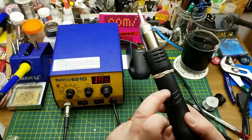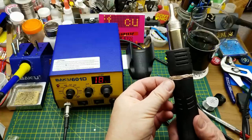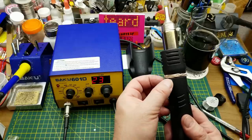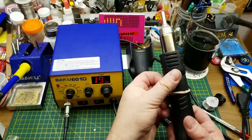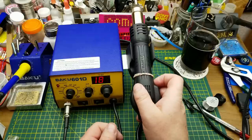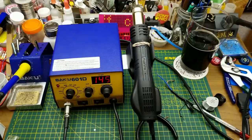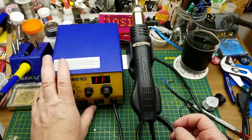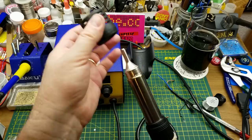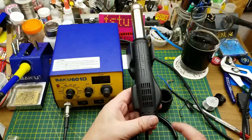It's all back together and tested — everything works. The only thing left is to fix the sensor issue. There's a little reed switch in the iron stand, and if I bring a neodymium magnet close to the sensor on the side it shuts off the heating element, kicks into high-fan wind-down mode, and the temperature drops. The same thing should happen when the iron is placed in its holder, and it does — except when holding on its own. That's what the elastic band was compensating for. I'll take the handle apart — a couple of Phillips screws — though the barrel is still around 100°C.